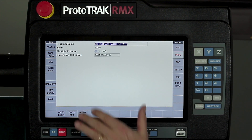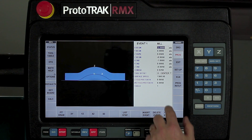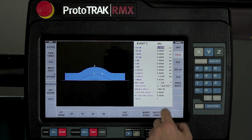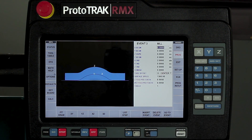In my program, I'm just going to walk through what I did. So you can kind of see on the screen what the actual shape is. Here are the same milling events I used in part one. I've got a milling event that's connected to an arc and it's moving in the Z-axis only, as you can tell. And then it's coming back down and running across the end of the part with another milling event.